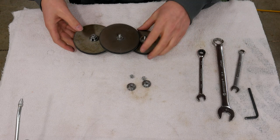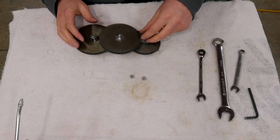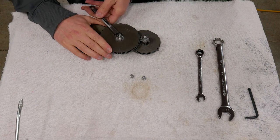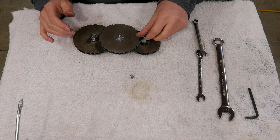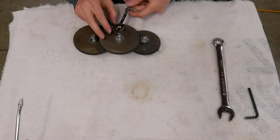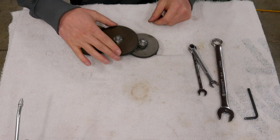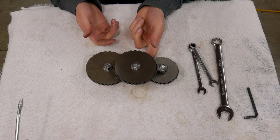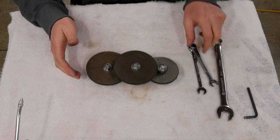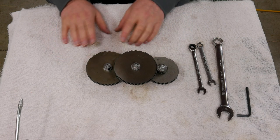For demonstration purposes, here are two of the nuts I just finished machining. They just screw down and lock fast to the shoulder because there's clearance built in — you can just crank them down with a wrench. I'm thinking this might be all I needed, but for now I've got some extra M6 nuts I'm going to use as jam nuts until I feel more confident I don't need them. Now I can't mount it to the lathe like this because I have to take the intermediate gear off to get it onto the mounting point, and then the large gear on the bottom mounts onto the lead screw. But that's all there is to it — these studs are now perfectly spaced, and for feeds I hope they never have to move.